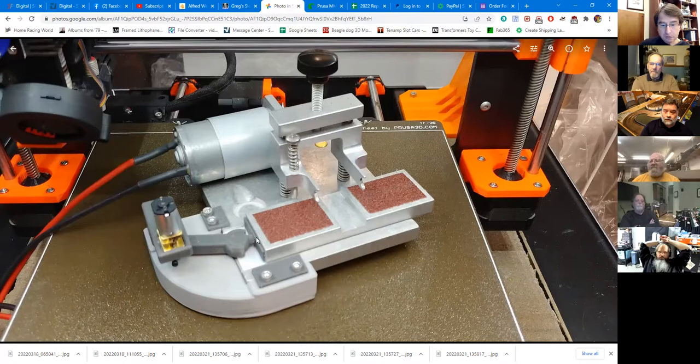He used magnets to hold the hitch to the arm. I did that at first, but I decided that the magnets that I had a bunch of in order to produce these for people if they wanted them weren't really big enough to do a secure magnetic connection between the two. Plus, I didn't want the additional hardware concerns and hassle of putting in magnets during a print or designing it so that you could pop them in, and other problems. So I went back to my ball and catch design, made it a little bit bigger. So that's a fully printed ball hitch joint. And I designed everything to not need supports during the printing process. So pretty much just put it on your printer and hit go. That's pretty much it. Any questions on this?